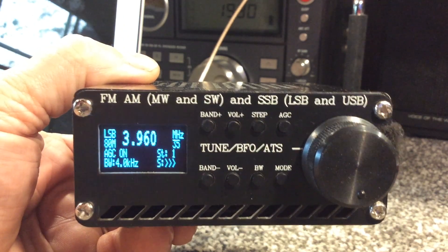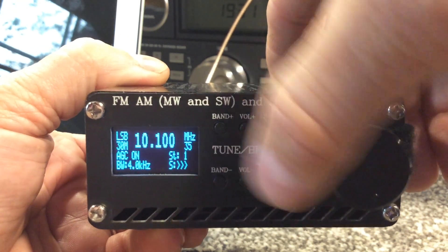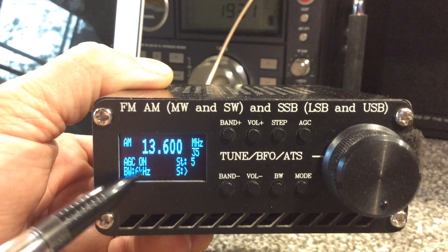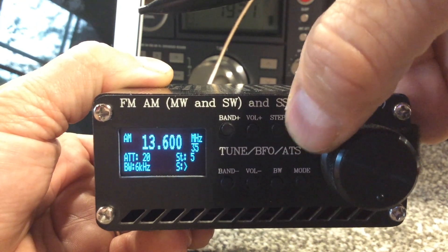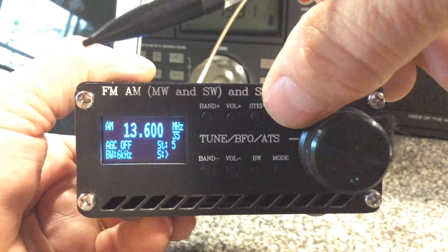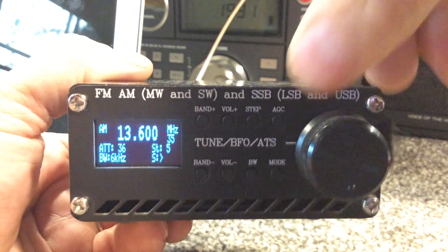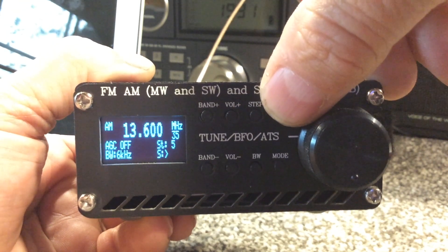We're currently on 80 meters lower sideband. Let's move to AM and see what's there. In the AM band, AGC is working and the bandwidth is much broader. You can also turn off AGC and change the attenuator. We repaired an attenuator bug — the original sketch was not written correctly. We added back in the minus 36 dB attenuation, which takes a signal quite a ways down. It was in the original software but just wasn't displaying correctly. So that's working now.